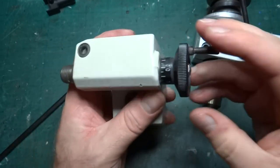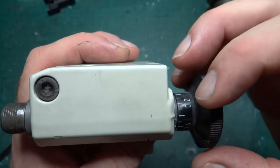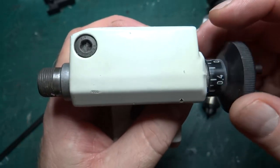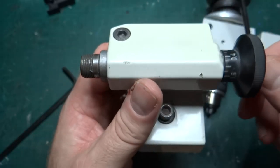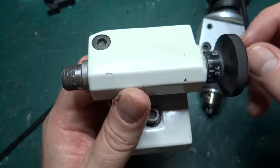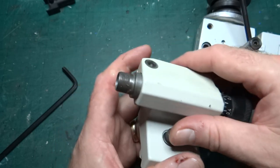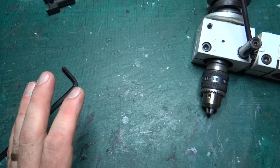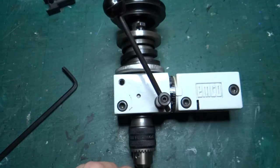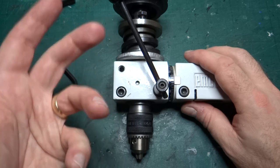The rest of the lathe is really nice and easy. The tailstock has a nice handle that's graduated where every mark is 0.1 of a millimeter, so it's easy to rotate and the tailstock gently moves out — if you're drilling using the tailstock on the lathe you can dial in precise amounts of depth. All the cross slide and the other axes on the lathe have that and it works really nicely, but the milling column doesn't. I'm guessing that's because most people would have used this mostly as a drill rather than a mill.